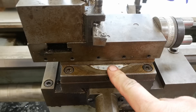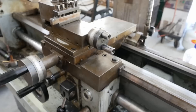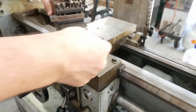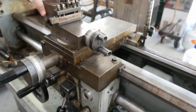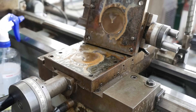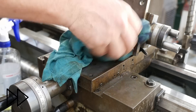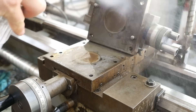It's pretty handy. To offset the top slide we go in here with an allen key, loosen off that screw and there's a second one under this side. Once they're both loosened off you've got free movement of the top slide - probably needs a bit of a clean under there. Lucky we took that off - obviously coolant's been used, gone underneath and caused a bit of corrosion.